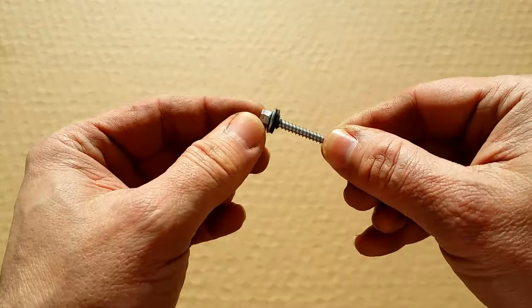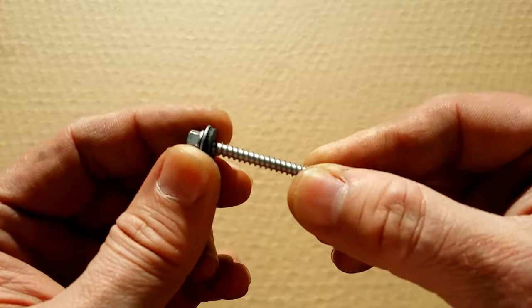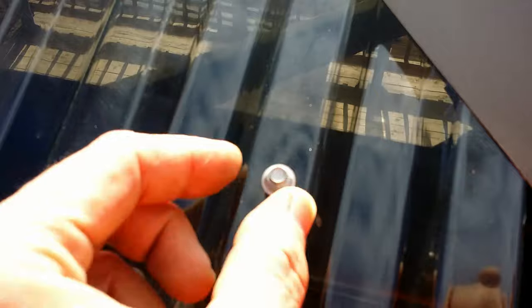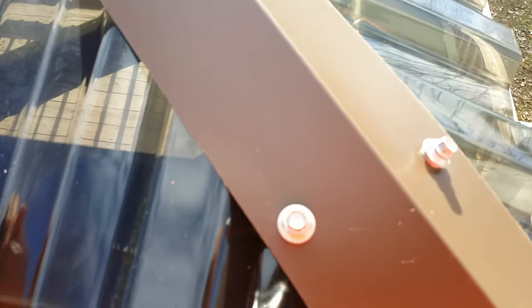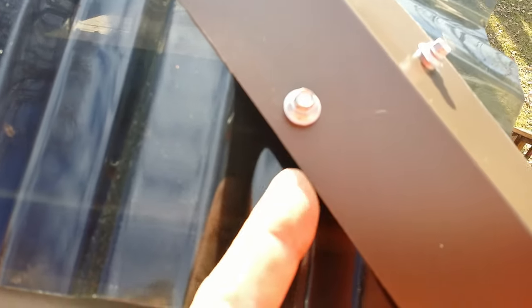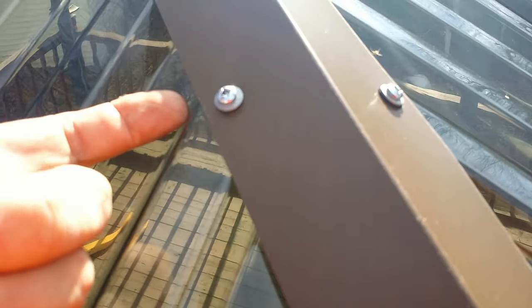There are special screws for those panels with metal and rubber washers. Pre-drill holes in the panels for the screws. Drive screws every second corrugation at the tops. I don't know the original purpose of the steel corners, but they work great for this purpose. There will be no problem with a screw going at the bottom of the corrugation since water will not go up the slope in this place. I attach the corners to the panels here because there is too much distance between the screws and I didn't want the wind to lift it up.